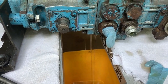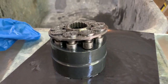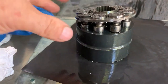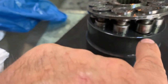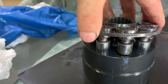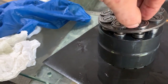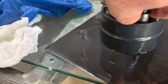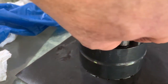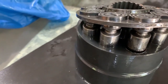I tore into this and was going to sand the rotating body — I was sanding the bottom of it and I believe I found the problem. It looks like there's a huge gap in one of the pistons — look at the slop in this one. All the other ones are nice and tight, but this one has a huge hole worn in the rotating body.